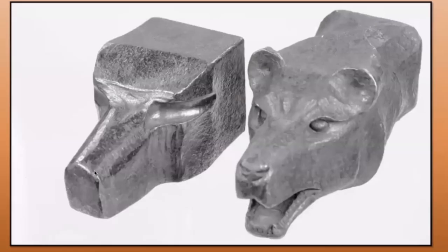We are going to move to the vise at this stage so we can start to put in the facial features. And I'm going to landmark the most of the important features by the eye socket here. So you'll notice that the socket is 50-50 over the bridge of the nose. So I want you to come in, level with the bridge of the nose with the middle of the tool, and then drive the tool in.